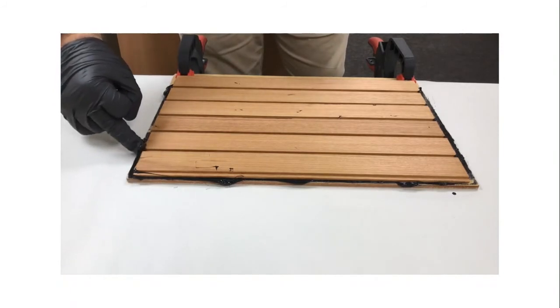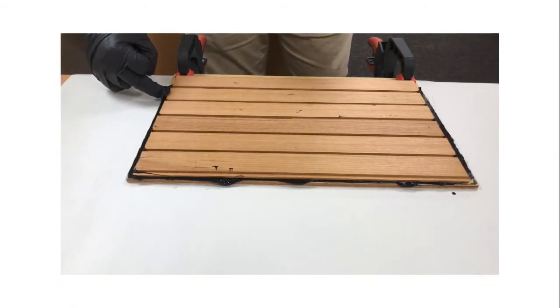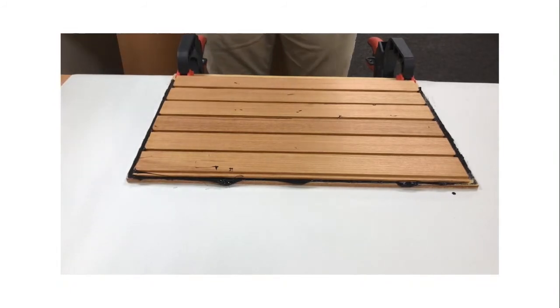If I say the usual rules apply, what I mean by that is anybody dealing with teak, whether they're coating it or bonding it to something, would try to give it a good clean and try and remove surface oils and that kind of thing before they try and bond it down. The same principle applies here. There is a cleaner, Cleaner 21, which we would use for that. That is naturally our preferred option, but there are other ways of doing it.